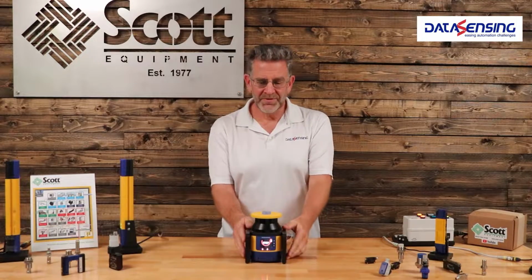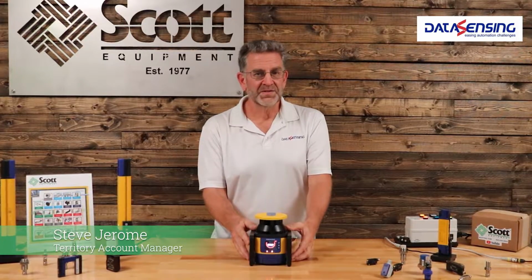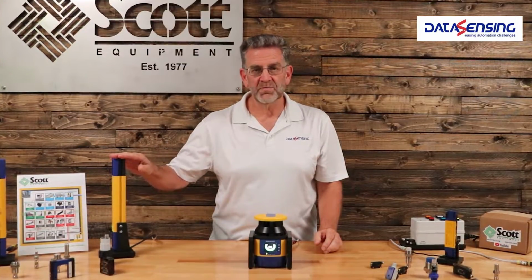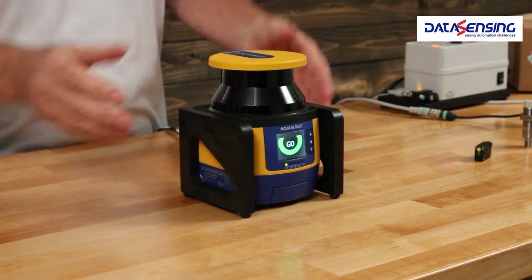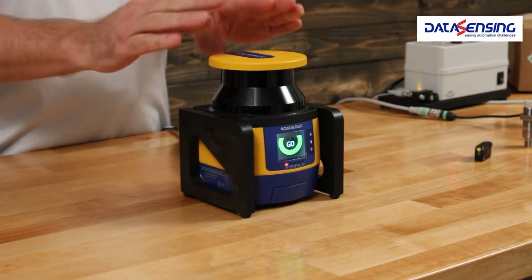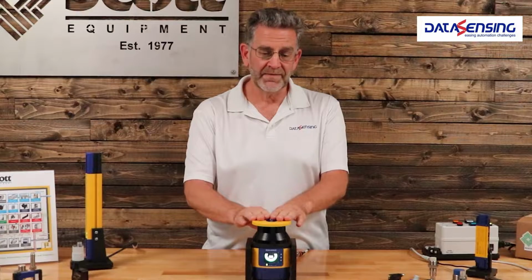Thanks, Mike. Today we're talking about the DataSensing Safety Laser Scanner. This is to protect people from machinery over a large area, where something like a light curtain will create a wall and keep somebody from reaching into a machine. The safety laser scanner can protect a large area. Range on these is up to 5 meters, so roughly a 15-foot area.